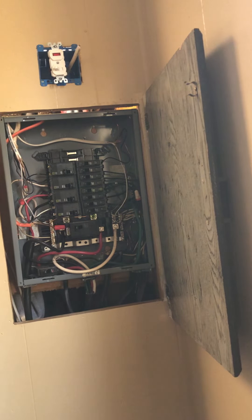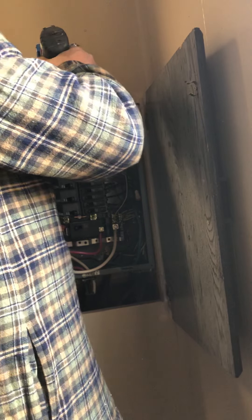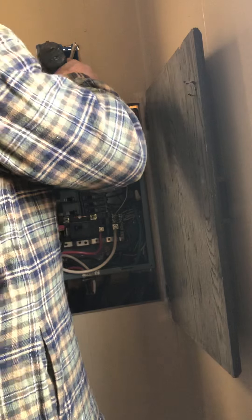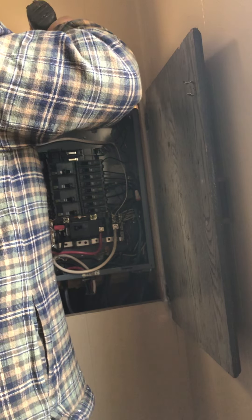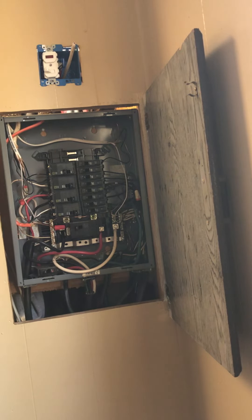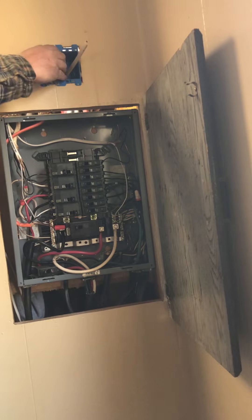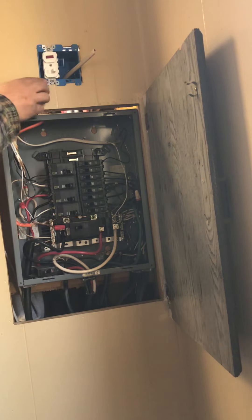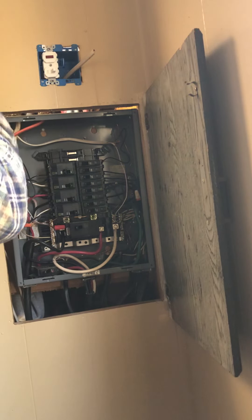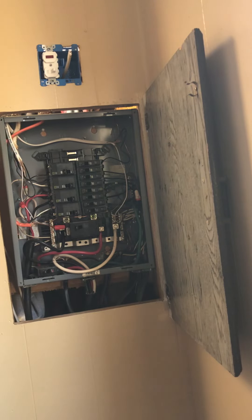Sometimes it's a pain to get these things in there — I've got all these wire nuts in the way. If the switch is sitting in there crooked like this one is, you can always take a pair of pliers and twist it a little bit so that it's good to go. So now this switch is complete. I've got power coming from the breaker to the switch, out of the breaker, down to the whip, through the floor. Now I can work on this heavy gauge wire, which is going to be for the heat tapes — we'll start that next.